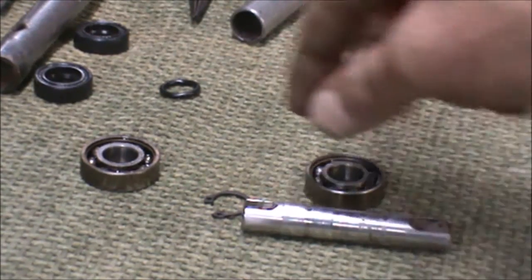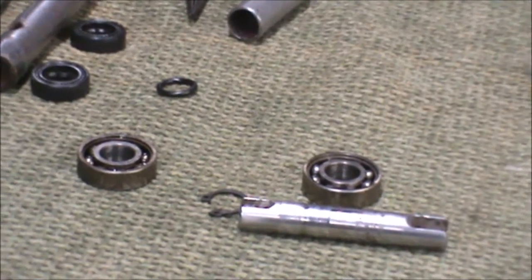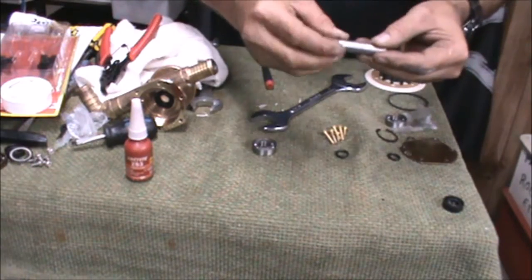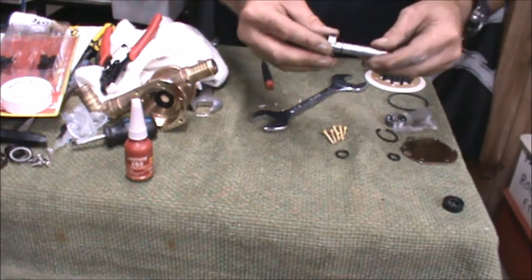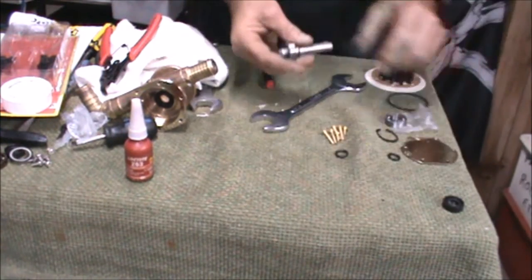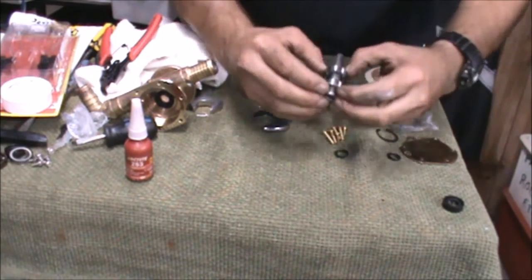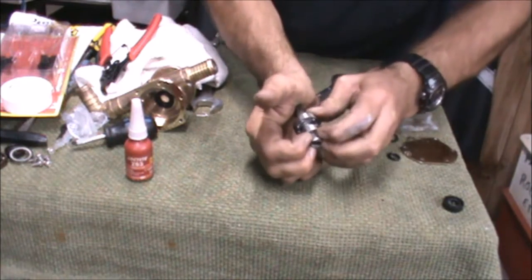The shaft itself has cleaned up quite nicely and so now the fun starts, it's time to rebuild it. You can see I've put the circlip on the shaft. The shaft's been sitting in the fridge for a period of time, about half an hour, to chill it down to try and contract it so that then the bearings would just slide on nice and easily. As you can see the bearings slid on part of the way, but nice and easily I would say not.